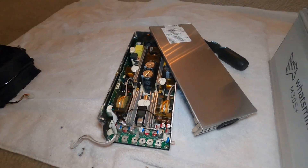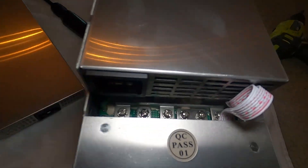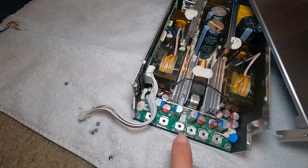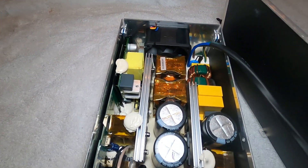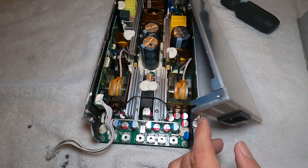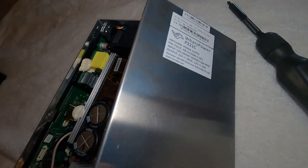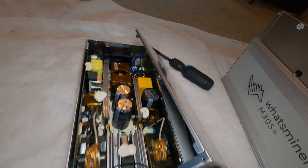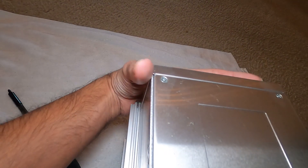This is effectively the end of the video, because while one side of the cable plugs into the control board and I can pop it off, the other side does not — it looks like it's directly pinned into this daughter board right here. This is a separate board that connects to the main power supply board. These are the internals of this particular power supply if anybody wants to pause and take notes. The seller just needs to get me a different one or my money back. To get this cover off, all it was was three screws on either side — the third screw on this side was behind a label, so very easy to pull off.